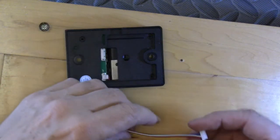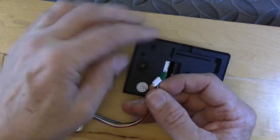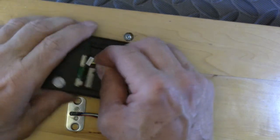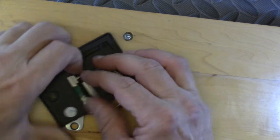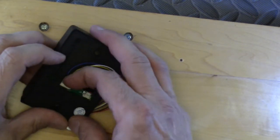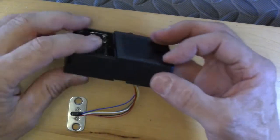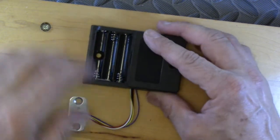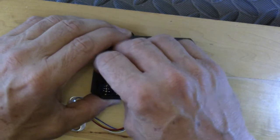Then you want to check your wiring harness and make sure you put it in the right direction. The easy way is to remember that the little contacts need to face up. It's kind of difficult getting your fingers in there to plug it in, so just make sure it's nicely seated. Once you have the wiring harness in place, flip it over and route the wire under the slot in the electronic lock. Then you can screw the electronic lock to the back side of the door.